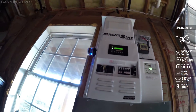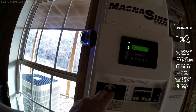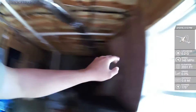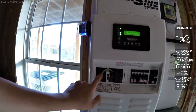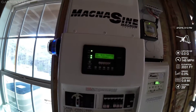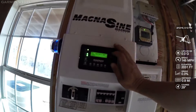This is the power feeding up into this breaker, which is the AC input. You've got your output breaker that's normally feeding the dedicated load sub-panel, and if they need to bypass it, it can be bypassed right here. This is a lightning arrester.